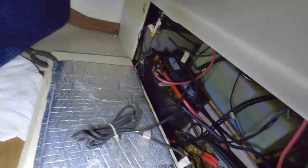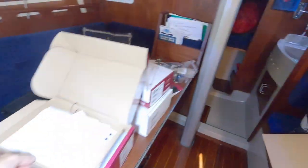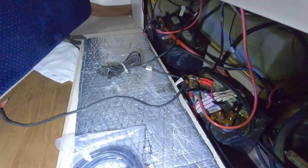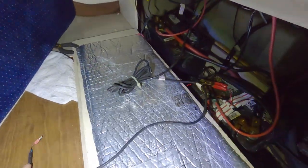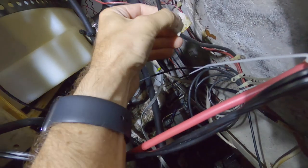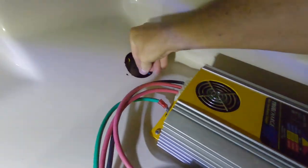This goes to the wheel drive and then up to the control unit — where you say you want to do a certain course and all that. The modern version of that is now this thing here. On this model the wheel drive unit plugs into a control box. The fact that this boat already had a wheel pilot on it makes this easier. I already have the switch for it here, that's fused or on a breaker, and when I come in here I can find the label tag that says 'DC to autopilot.' I can see that wire wiggling — so these are my power wires that I can take off this old unit and pull them down.